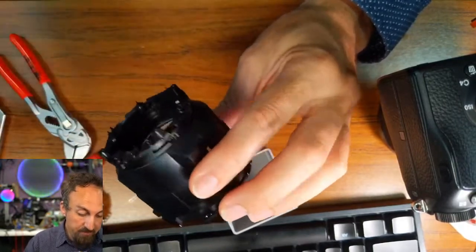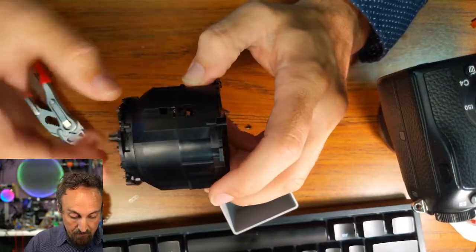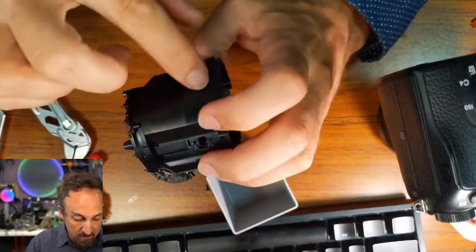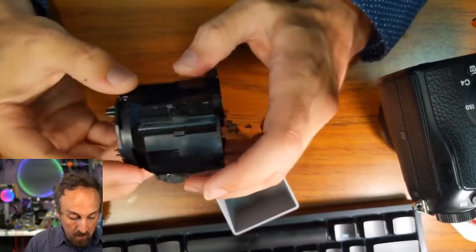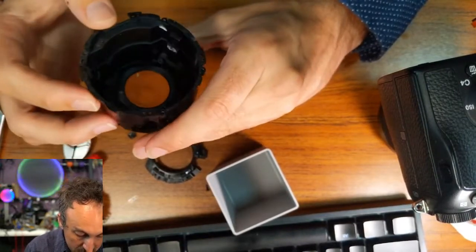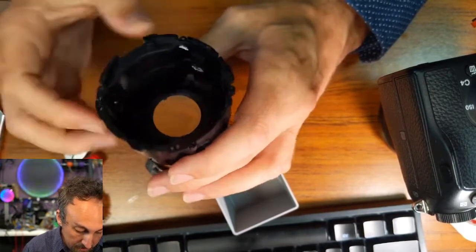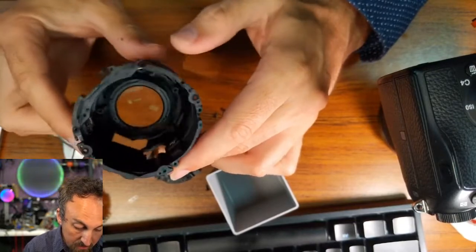These look like they all could have come off the face of this internal mold, but you actually have this whole undercut ring here. I'm assuming what happened here: these look like they're on the same axes, so this is probably all one action. And there's what look like might be split lines here where the whole outer shell might have come together from a couple of places. And maybe that's how they did it. I was looking to see if there were any obvious internal actions on the core of the mold. It's not obvious to me that there are. There's fewer blind recesses on this side, but it's still incredibly complex, with so many tiny little features.